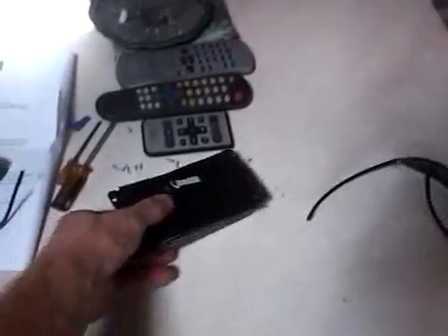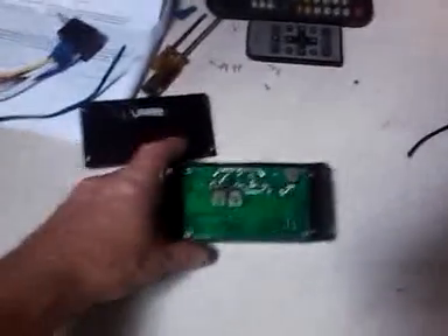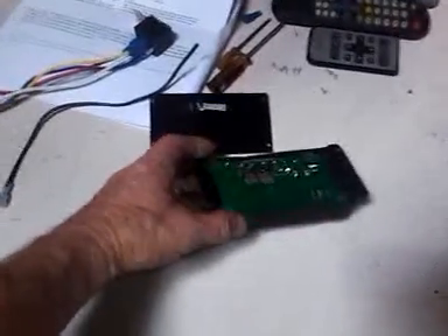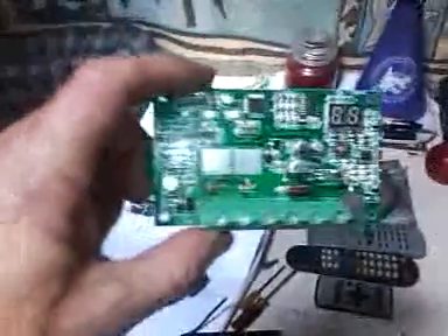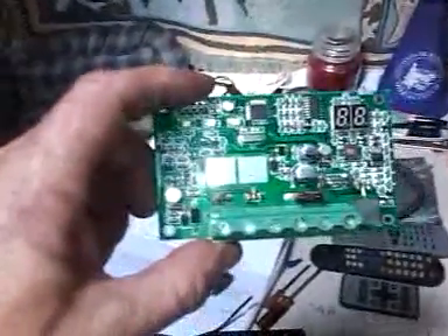Now let me go over the difference between the charge controllers. This is a store-bought charge controller and here's one big difference — most of them are plastic, and can you see that it melted bad? That was partly my fault because I was running too many watts. They say they can handle so many amps, but it says 30 amps — they only really run about 360 watts, and I had 600 watts going through it, so that's what happened.